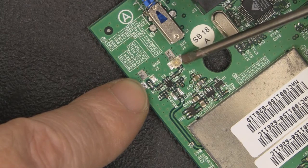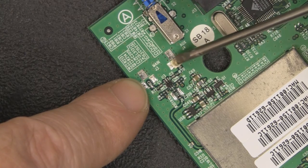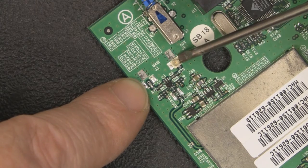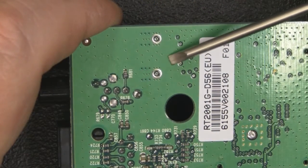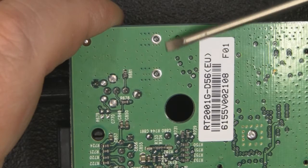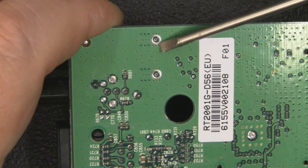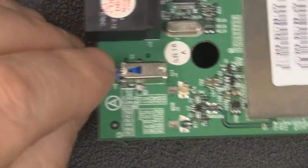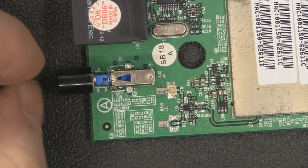Here's a closer look at the two traces. I'm going to get my soldering iron, come in at the side, and slowly heat all the copper on that U.FL connector, then hopefully a little push and it should come away from the solder pads. Make sure you get plenty of heat in there first — if it's not all uniformly heated and melted, you could easily rip one of the traces away. Also interesting: on the underside of the board, the outer circle is your ground plane and the inner circle is your signal wire, so you could solder onto the back and leave the U.FL connector completely in place as another option.